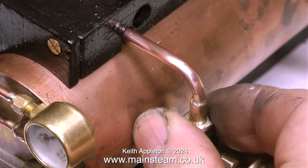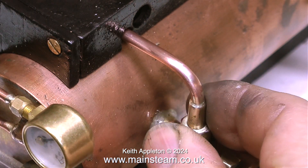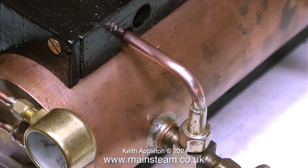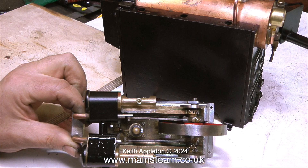The other end of the pipe was sticking out of the bottom of the boiler about six inches. First I tightened the union nut so I knew this part of the pipe would stay in position, then I turned the boiler on its side and manually bent the other end of the pipe. After that I silver soldered the union cone onto the other end of the steam pipe — not forgetting to put the union nut onto the pipe first.